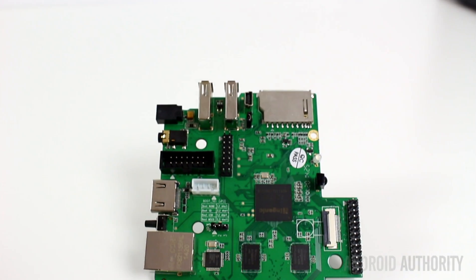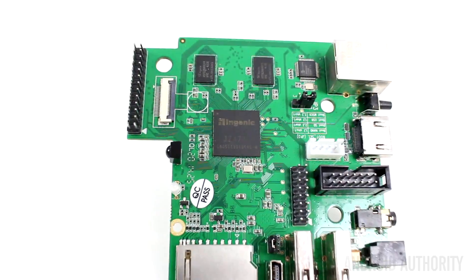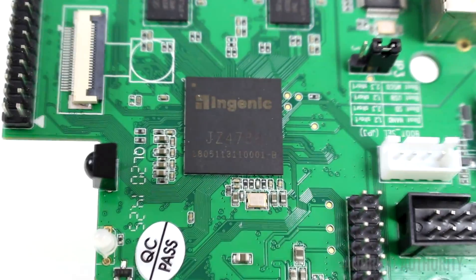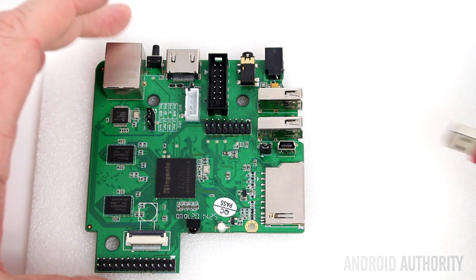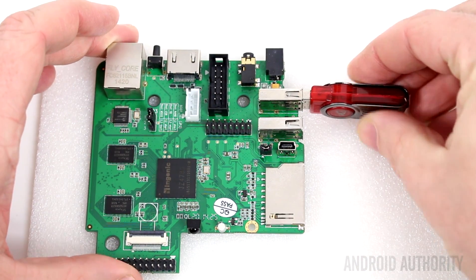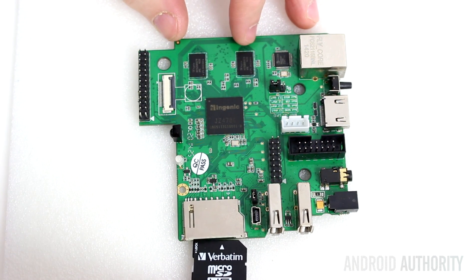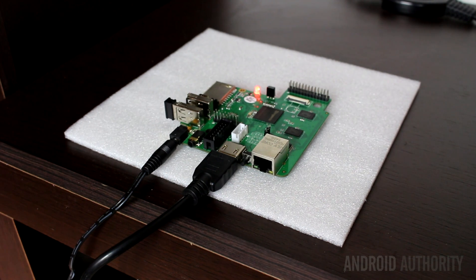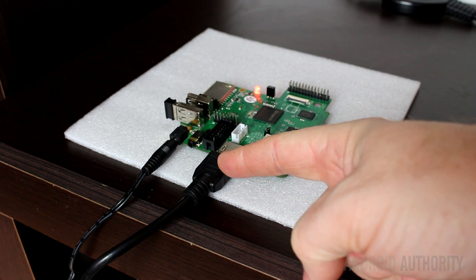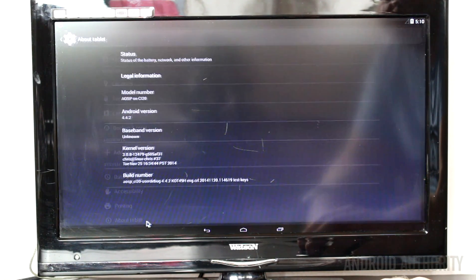There are also a few other minor problems with the CI20. Having used several different ARM-based media boxes, I had high expectations of this board — I had visions of being able to build my own media box using the CI20. However, there are several key things that don't yet work under Android. The most important is support for external USB drives. Although SD cards can be used, and I was able to play a movie from the SD card without any problems, I was unable to use an external USB flash drive — it simply isn't recognized by Android. Unfortunately, when playing a movie from the SD card, the sound didn't work over the HDMI cable, and neither did it work via a Bluetooth speaker. Also, while Wi-Fi works, there are no settings for the Ethernet.